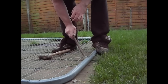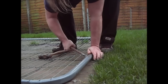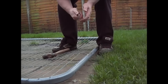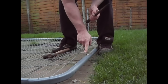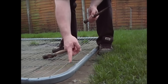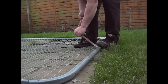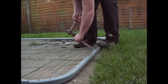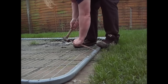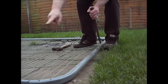The other way you can do it is by squeezing - get the chisel in there, twist the metal up, and you can break it like that. The downside is it bends the grill, so if you want to keep the grill for another job it will bend it slightly. The easiest and fastest way I've found is the first way: put the chisel underneath the weld and strike it hard a few times. You're much better off hitting it hard a few times rather than many times - and that goes straight through. Just go all the way around breaking the welds off in that manner.